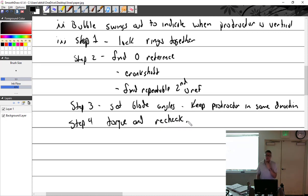When you loosen all of the blade clamps, the blades sag. When you tighten them, they come back up. You need to have the blades perfectly level, because you're not going to get an accurate reading if the blade is tilted. When it's level, put the protractor on and watch — it's going to move. So the blades have to be perfectly level when you do that.